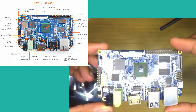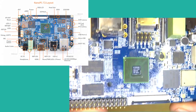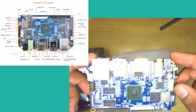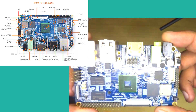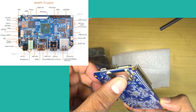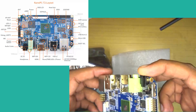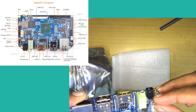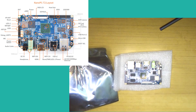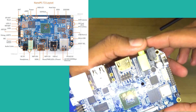It is Samsung but it's not an Exynos SOC — it's a 1.4 GHz quad-core Cortex-A9 processor. Next we have the Raspberry Pi-compliant GPIO pin header, 1 GB of RAM, DVP camera, a full-size SD card slot, a real-time clock battery socket, external USB port header pins, micro USB for data only, and a boot select button to choose between SD card or internal storage.